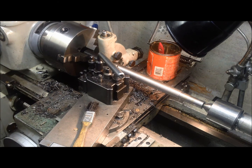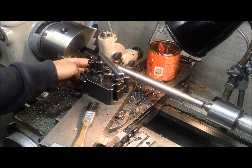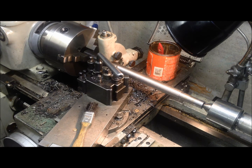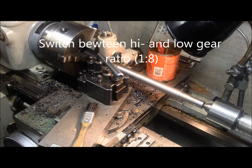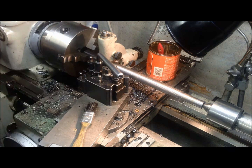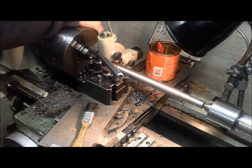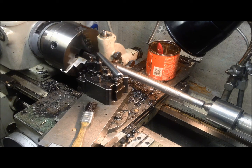I'm taking it that slow because I don't want to mess up any more. When I reach the end of the pass, I take the cross feed out, stop it, and reverse. To reverse a little bit faster, I select high ratio — back gear is on — and then I select the high ratio so it still keeps the nut engaged, and I run it in reverse back.